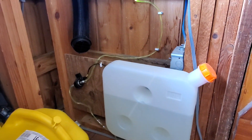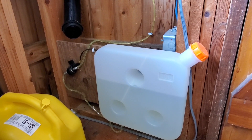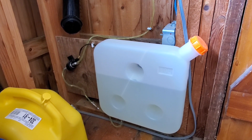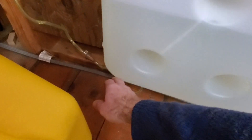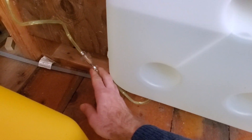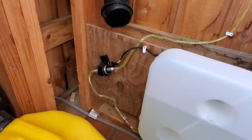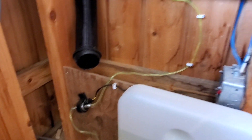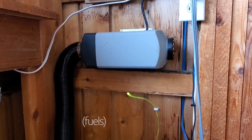You can also get an idea here of how I've got my fuel tank set up. I've just got it mounted to a piece of plywood, and that fuel tank feeds — it's hard to see here — a fuel filter, which then goes into the pulsating pump, and that pump pulses a certain dose of fuel up into the heating unit, and that's what powers the unit.